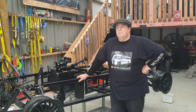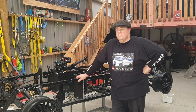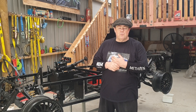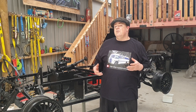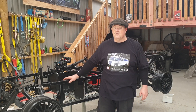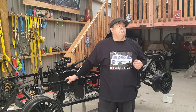What's happening for this car in the coming week: rebuilding and mounting the front calipers. I need to get some brake lines swaged up. You can get brake lines that are screwed together from many aftermarket performance car places, but in New Zealand that is illegal — they need to be swaged. You can run braided line, which is probably what will be at the front, and I'll have a mixture of hard line and braided line. Either way, it needs to be swaged; you cannot have the screw-together style.